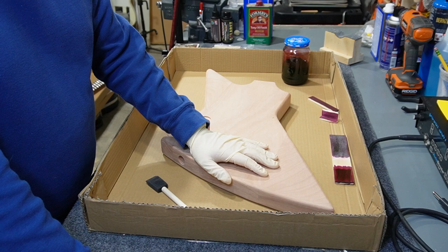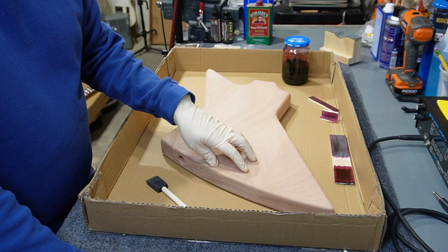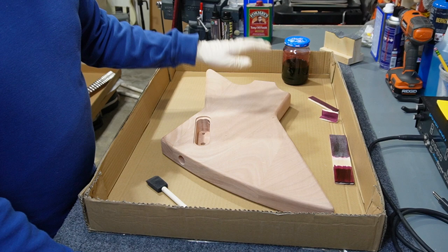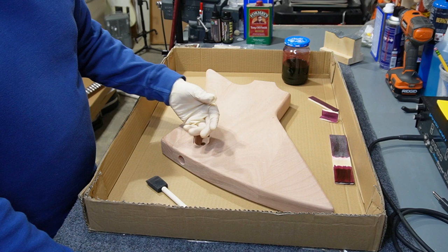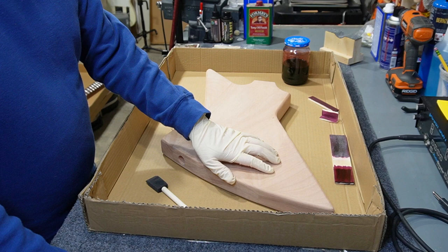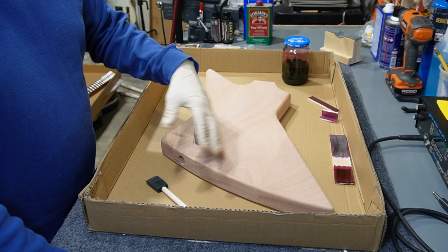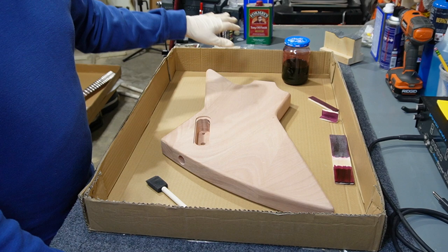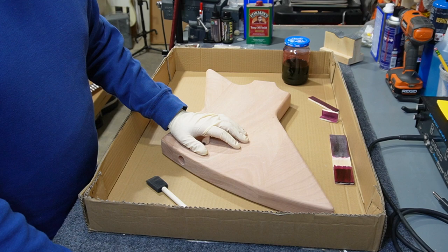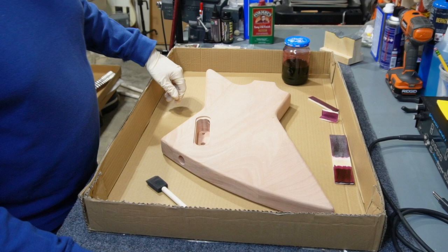I'm not going to do a final sand to raise the grain or anything. This is an alcohol-based dye, it shouldn't raise the grain all that much, and I'm not going to be mad if some grain gets raised anyway because I want a kind of textured look to the finished product. There will be a couple of coats of oil, then a sanding process between those - it'll probably be more like steel wool to knock down any imperfections and leave some texture. The nice thing about tung oil is it dries within 12 hours so you can do it twice a day and build up coats quickly. I've also read that tung oil and true oil work really well together, so I might do the neck in true oil.